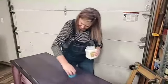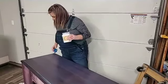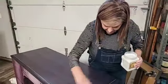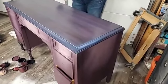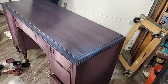Have you ever put satin on top of gator hide? Yeah, you can do that too. They're water-based top coats, so they're interchangeable. Although if you do satin on top of gator hide, your top is going to be your satin finish. Your protection is going to be underneath your satin. So if you're looking for that tougher clear coat, you want it to be on the top.